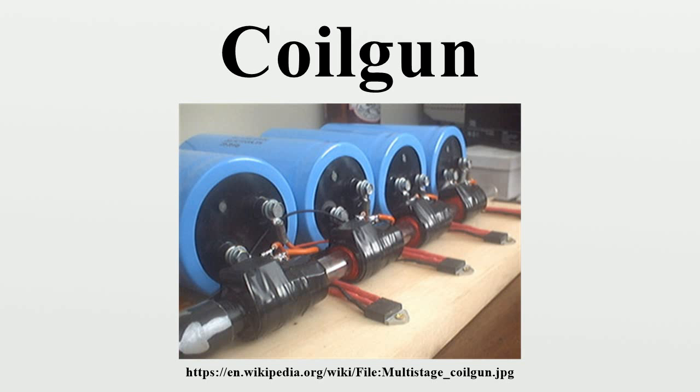The electrical resistance of the coils and the equivalent series resistance of the current source dissipate considerable power. At low speeds, heating of the coils dominates the percentage efficiency of the coil gun, giving exceptionally low efficiency. However, as speeds climb, mechanical power grows proportional to speed, but correctly switched, the resistive losses are largely unaffected, and thus these resistive losses become much smaller in percentage terms.